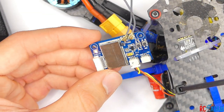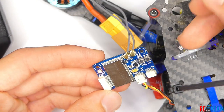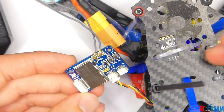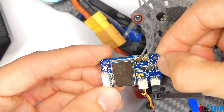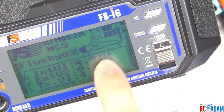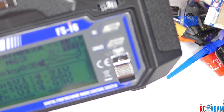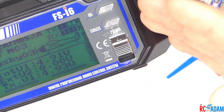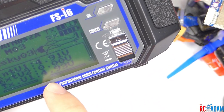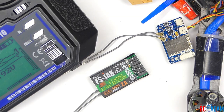Just remember to press that button. A helpful extra tip: some of the newer receivers will go into bind mode automatically, so you don't even have to press the button. Sometimes you can also put them into bind mode using your flight controller in the Betaflight configurator or whatever configurator you use — but this method is sometimes the simplest, even though you do have to reach the bind button. The RX voltage will pretty much always read around 5 volts because it's regulated from the quadcopter electronics. This harkens back to the older days of RC flying when you had a dedicated receiver battery — the voltage reading would tell you its charge level. But in this case it doesn't really matter, because as long as your main quadcopter battery has enough juice to keep you flying, it definitely has enough to power the receiver.